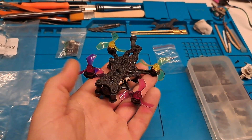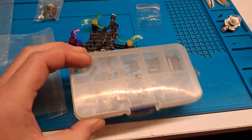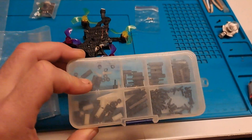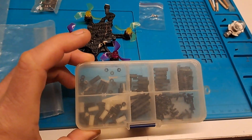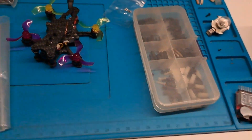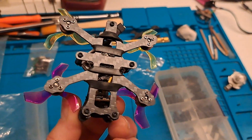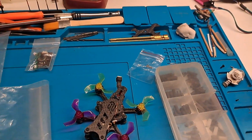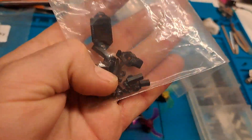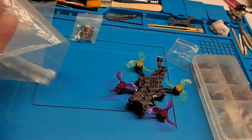The solid pin connector needs to be re-soldered, it's a bit loose. Nice little quad, but you're going to need some extra hardware to build it. These plastic standoffs are from Suelve - the smallest 2mm ones, actually just for computers. I went with all nylon screws everywhere for mounting instead of the metal screws, and that saved about four to five grams.